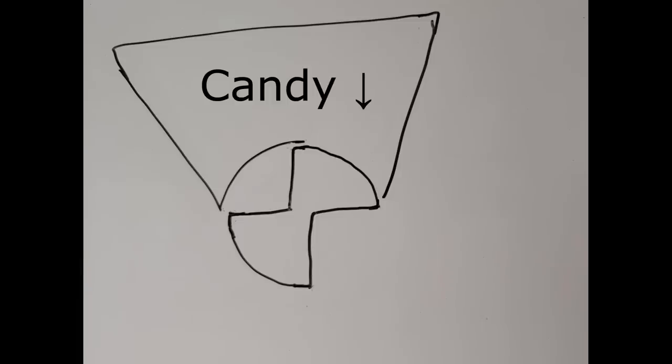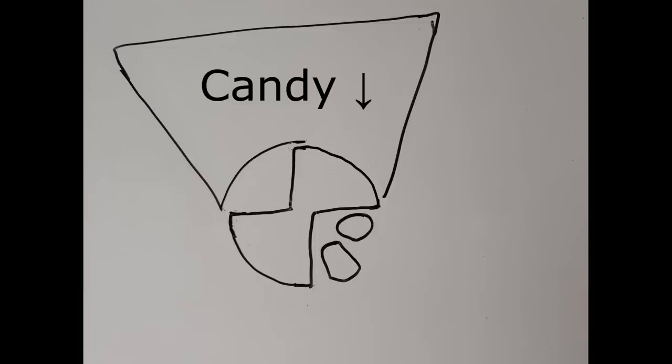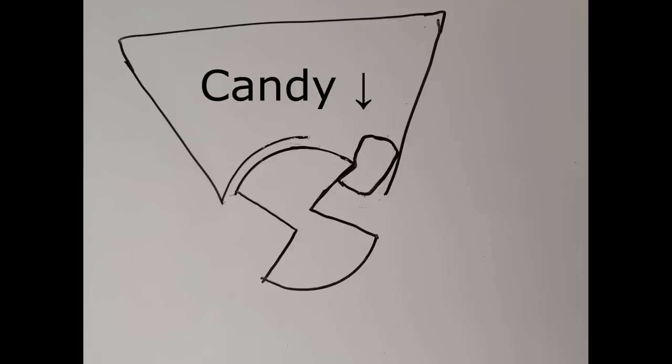Our second idea was to use a rotating door. One section would have an opening that the candy could flow into. Then, as you rotated it to the second position, it would pull that candy out with it while closing it off to prevent unwanted flow. This would really help with the portion controls. The biggest challenge with this design would be making sure we got the spacing right to prevent any type of jamming, as well as preventing crushed candies.